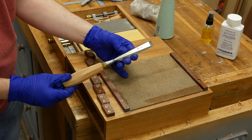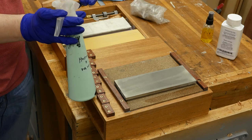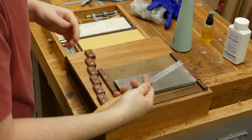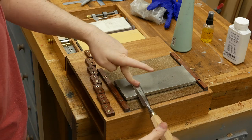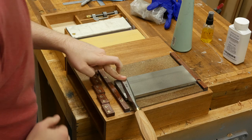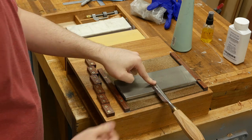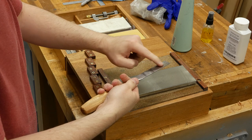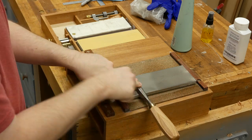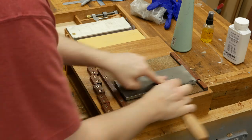This is the chisel I'm going to be flattening and polishing. To begin, I'm going to use my coarse DMT diamond stone. I use water with a little bit of what they call Honerite — this makes the water non-corrosive. I just spray this on the surface, lay the chisel flat. I like to have about half of the chisel on the surface and do a few swipes, then move it up so it's almost to the edge and do a few more swipes. If you keep the chisel in one area on a brand new chisel, you're going to end up cutting a groove in the back — you're going to have a step.